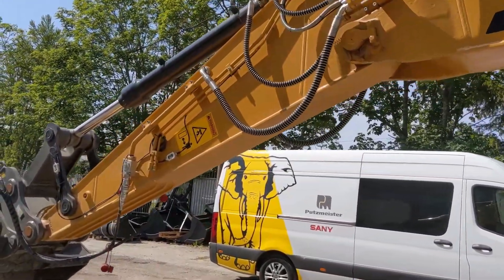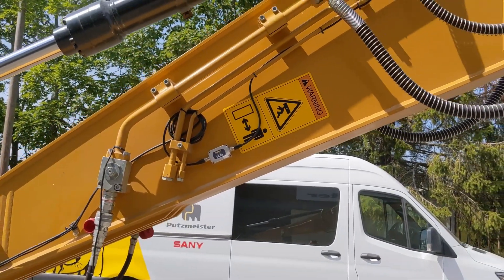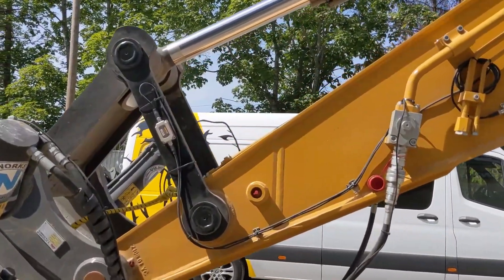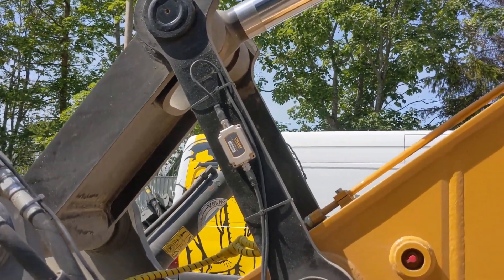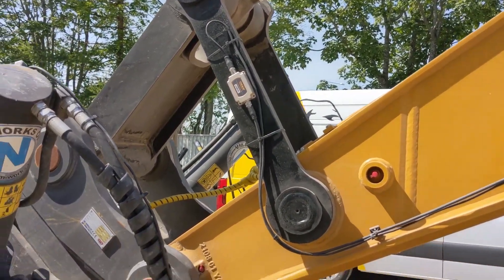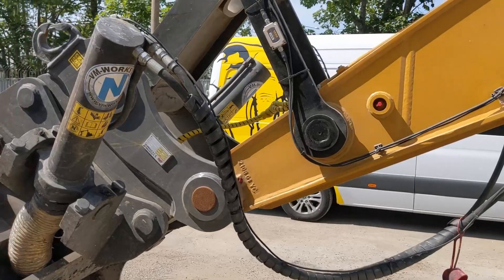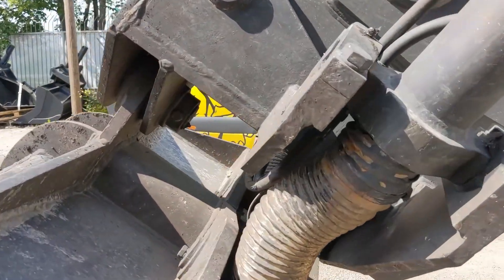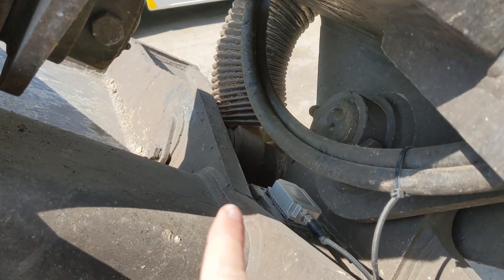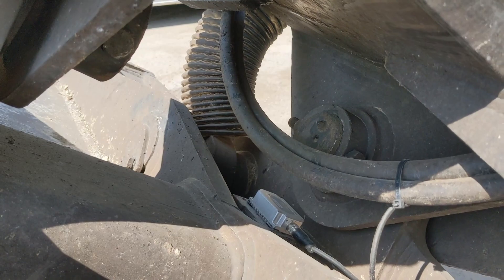Obviously it needs to be connected in order to work, and the cables can run up to the boom. Next we have the boom sensor which goes onto the boom — we try to level it with the boom from axis to axis, more or less, because we will be calibrating it anyway. Then the stick sensor goes onto the stick, aligned joint to joint. Then the dog bone sensor goes on the dog bone, aligned similarly — not to worry too much as we will calibrate them anyway. And then the bucket sensor, where the cable is routed through the hydraulics. This last sensor is the 101 sensor with only one port, which terminates the sensor line.